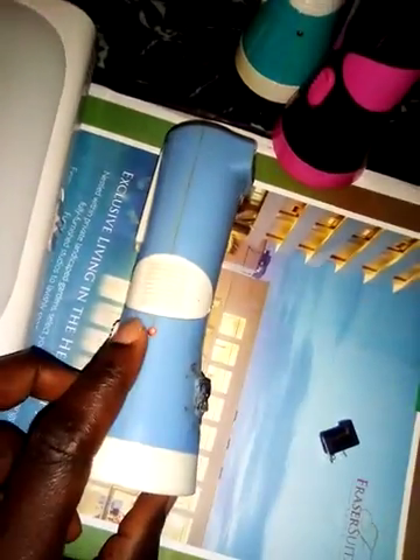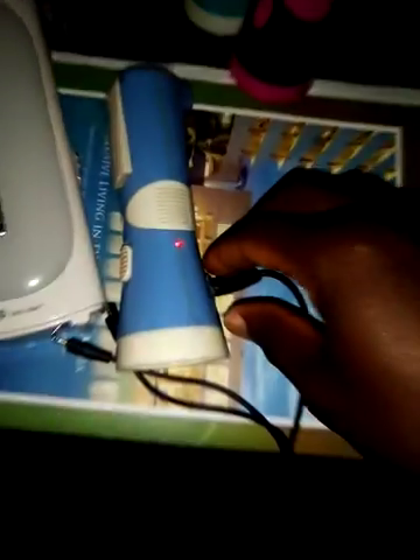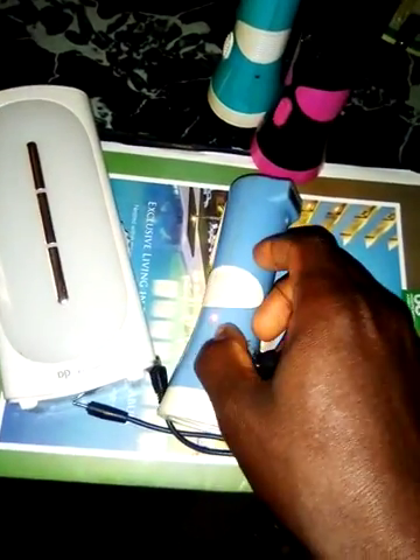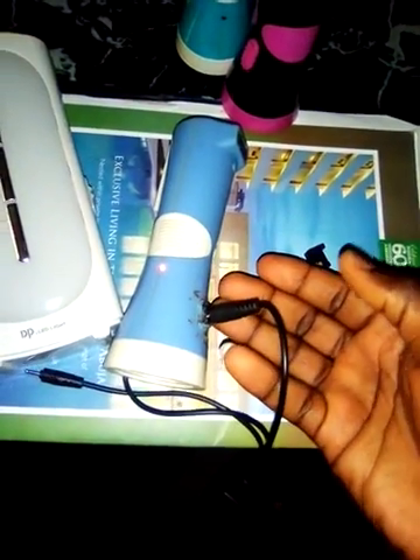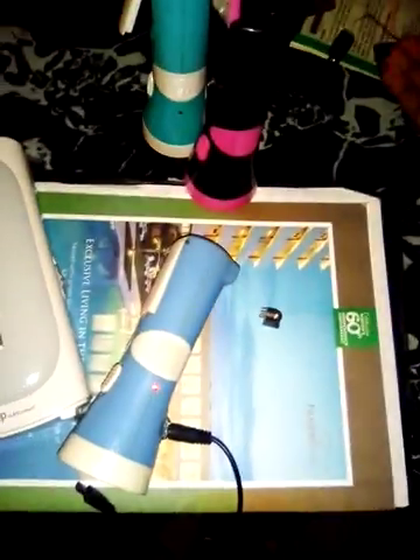Look at the indicator — it's not showing a red light. Look at the solar panel. I'll connect it now — you see? You are seeing the red light now — it's charging! That means I can use a solar panel to charge this same rechargeable lamp with the aid of this modification and the replacement of the battery inside. Very simple.